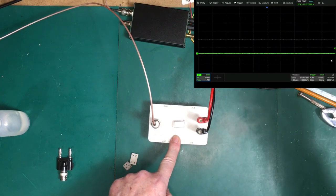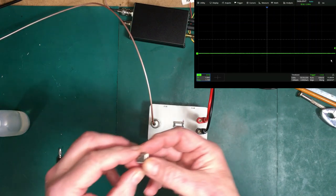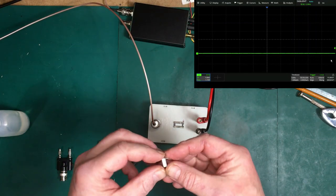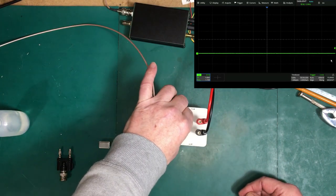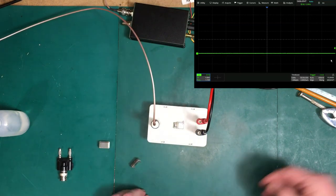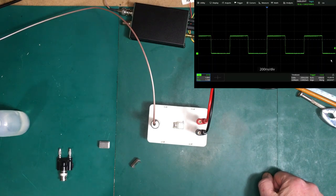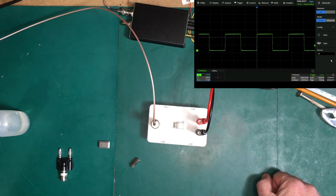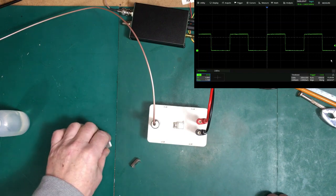Power off. We'll try this one here. This one is a 1.84320 megahertz oscillator. Power on. There we go — nice rising edge on that one, eh? That's about three nanoseconds rise time on that. That's a good oscillator. Two good oscillators.